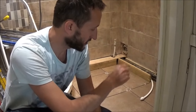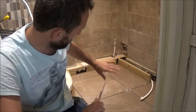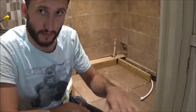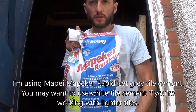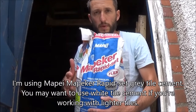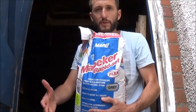Right, now I'm ready to lay the tiles. I'm going to take these tiles back up and stack them back in order so that I'm able to place them from that end and work back towards the door. When they're all laid, I can leave the room without having to walk over them and let them dry. This is what I'm using for tile cement. When using this, you want to put water in your bucket and you always add the powder to the water — but read the back of the instructions as it'll tell you for that particular tile cement exactly how much to use.